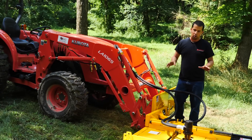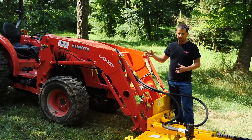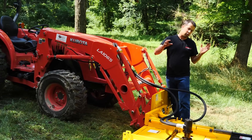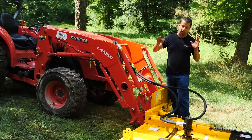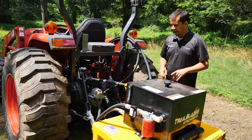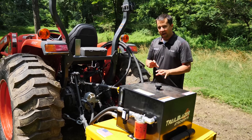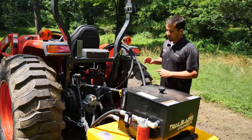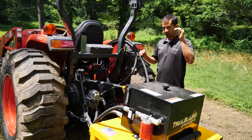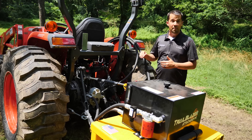Keep that in mind — if you go into grasses 3 feet high, this isn't going to perform as well as a PTO-powered mower because you're just not delivering that amount of horsepower out to it. We need to be looking for applications where it's not for everyday mowing — it's for those unique, challenging places where you just can't get a traditional mower. In the back of this tractor, we have the Titan Power Pack. This is a unique piece and the principal reason why we're choosing to work with this particular company. Most small tractors are not going to have enough hydraulic flow to really run this thing up to its potential, really maybe only scraping up against the minimum. The Power Pack gives you more than adequate hydraulic flow to deliver a lot more horsepower out to that mower and make it work its best.